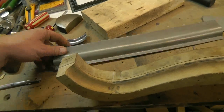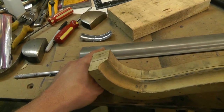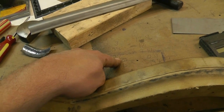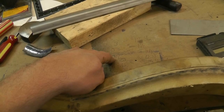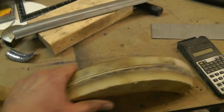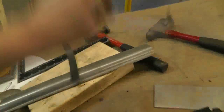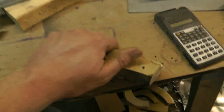The idea is I could cut it all from the same side, but what ends up happening is I'm not closing the cuts - I'm opening them up. That would mean I'd actually have to make up almost half an inch of weld. Spread across fifteen cuts it wouldn't be that big a deal, but that's still an awful lot of cuts for that length and an awful lot of pieces to weld up. So I think what I'm going to do is take my little die grinder blade, which is a little wider - looks like it's probably about a fifty thou cut - and recalculate these numbers.